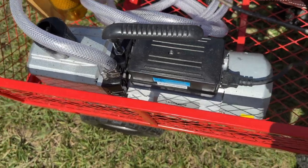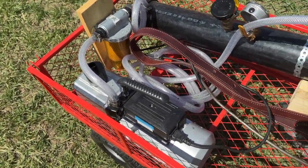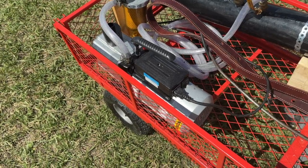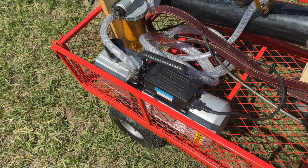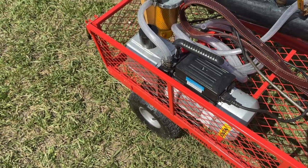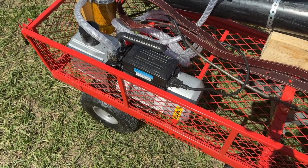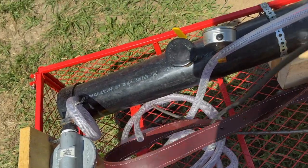We ended up buying a 12 CFM VEVOR vacuum pump — I think we got it off Amazon but you can buy it directly from the company as well. We went with the biggest one they had because we weren't sure if it would be large enough to operate our milking machine, but now that we've been using it, it is plenty big enough and could probably run two to three cows easily. You don't need to go this big, but you do want to research what type of milk bucket you have to make sure you get a pump large enough. I believe around five to six CFM sounds right for what the surge bucket milker requires. We just plug it in to an outlet or an extension cord.